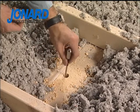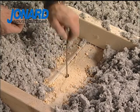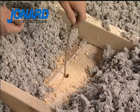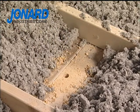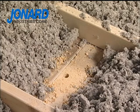Once the leader makes contact with the insulation, apply slight pressure and rotate until it freely drops into the insulation. At this point, move the leader up and down in the insulation to create a pocket for the drop magnet. The pocket must be within one half inch of the sheetrock for the retriever unit to correctly couple with the drop magnet.